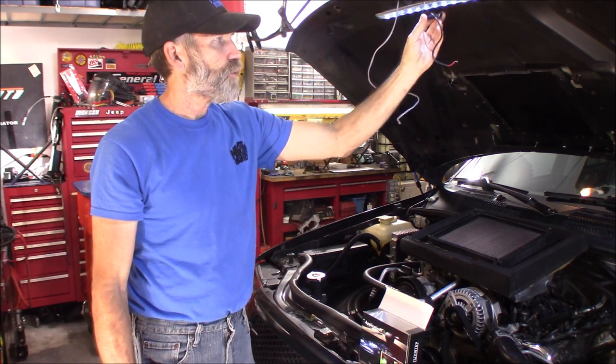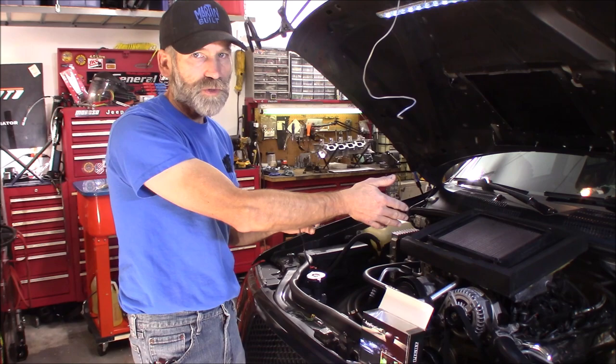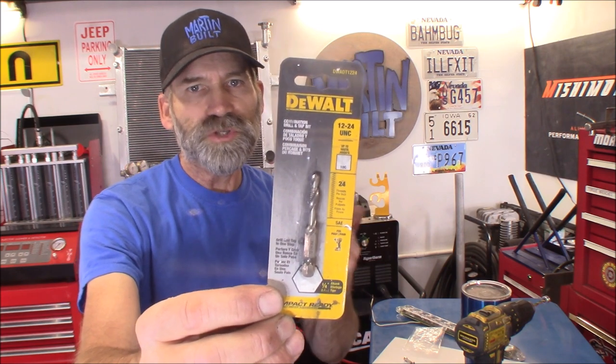I'll put two there. We're going to remove the old one and replace it with one of these, so now we're going to get light shining down on both sides of the engine and one down toward the middle. Let's get started. The lights come with an Allen bolt and nut — a self-locking nut, M6 by 1.0. I'm not able to use them because I can't get the nut behind it, so I've got some screws I had laying around. This is a 12-24, kind of an uncommon size, but in my field of work we use these all the time. What I'm going to have to do is drill and tap. I got a tap that fits right into my quarter-inch drive DeWalt and I'm simply going to drill and tap those holes.